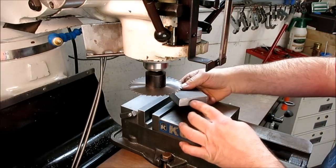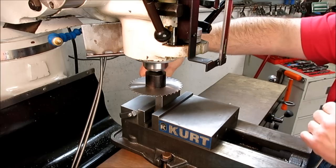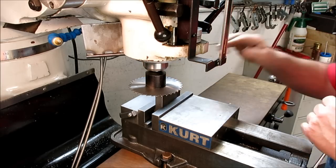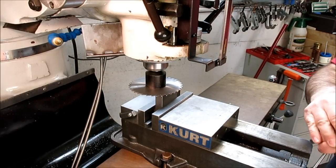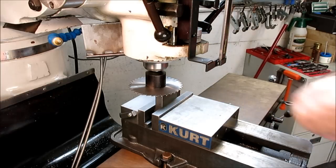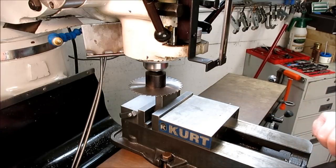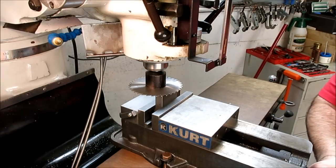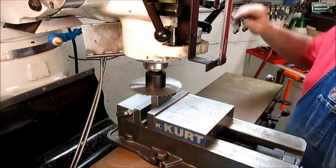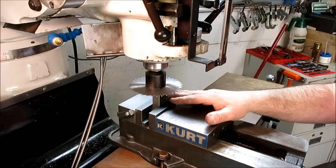I've got parallel edges on both sides. What I normally do is start the saw and hold a piece of post-it note. I come down very gently, and when it takes the paper away from me, I know I'm about two to three thousandths of an inch off that surface. Then I drop down half the saw thickness and recalibrate zero — that way I don't have to think about it. You can also pick up the periphery the same way — slip a piece of paper in and come over in Y.